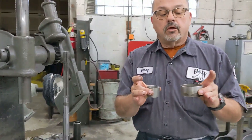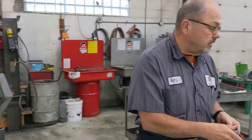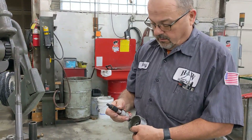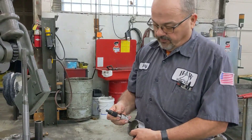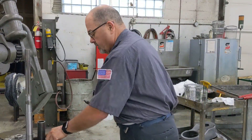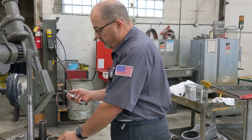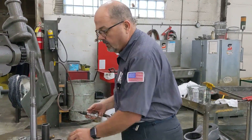Okay, so now we are ready to reassemble our spindle. The first thing you always want to check is your spacers that go between your spindle bearings — these need to mic the same height. So just get your mics. If you feel like they're out you can mic them in a few different places. These mic exactly the same: 1.342 roughly.